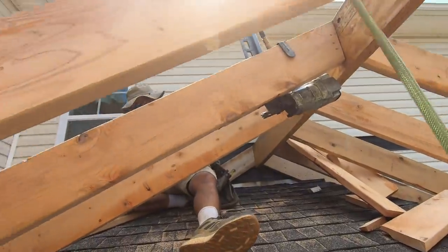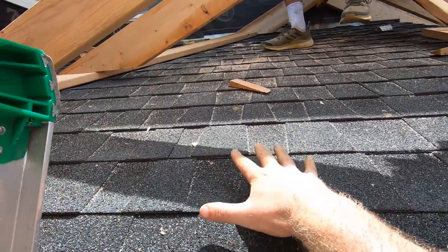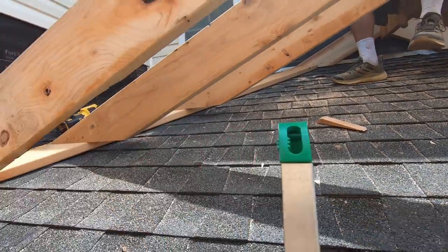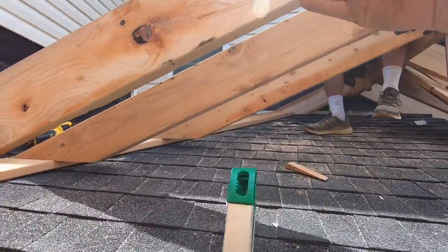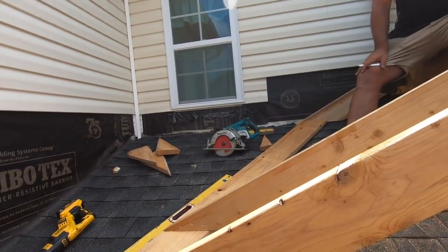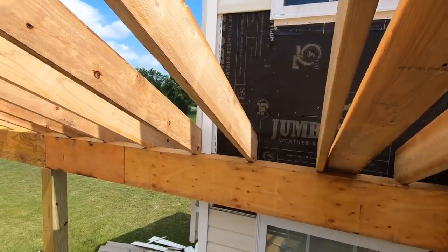We're on to the really tricky part of the roof here. There's already an existing roof here - a lot of people were asking me on Instagram about this, like why is this still here. We're trying to leave this because the house is right underneath and we don't want to rip it off and then worry about weatherproofing it and scheduling with the roofer. We're going to be tearing off this soffit, this wall will go straight up to our vaulted ceiling. Under the window we're basically going to have a flat roof that comes out, and all the water coming down this side of the gable roof is going to be diverted down to that corner into a downspout.